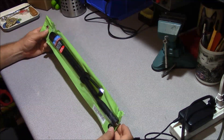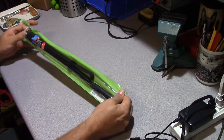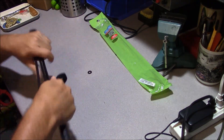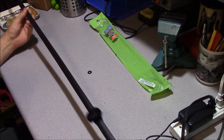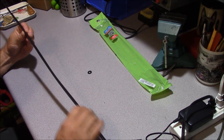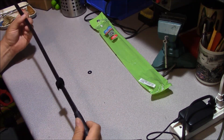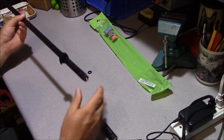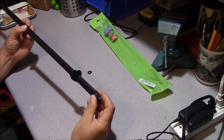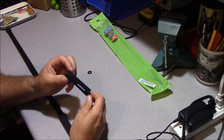Here we have the Ebre 42 and a half inch dual band antenna. Let's pull this thing out of the package and see what all the hubbub's about. It folds out to be 42 and a half inches long — it's a blade of what feels like a tape measure type of thing, covered in heat shrink tubing. It's got a threaded retention down here with a couple of machine screws and lock nuts through this threaded stud to retain the element. Someone cut one open in another video and there is a coil inside, so it is a base loaded antenna of some sort.